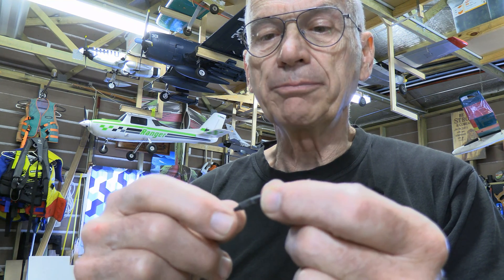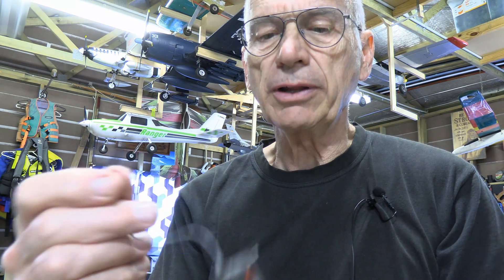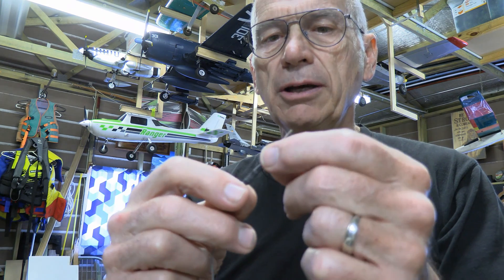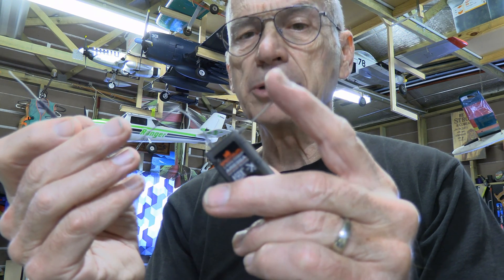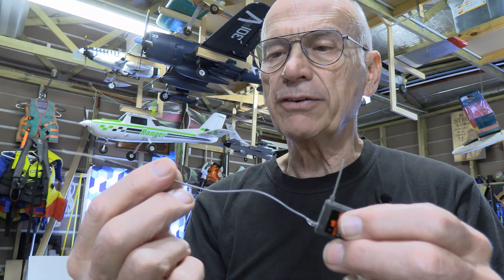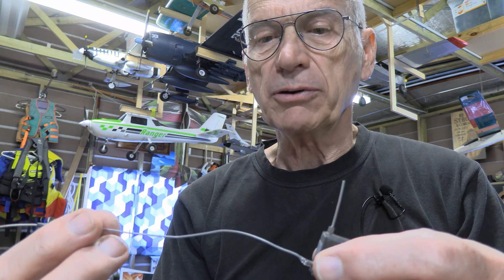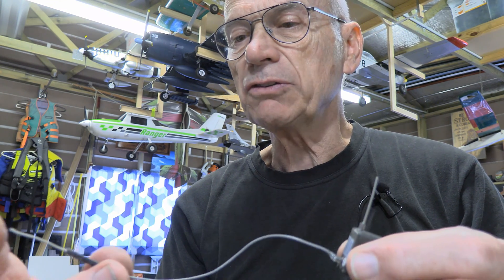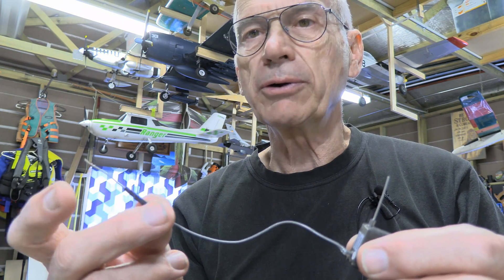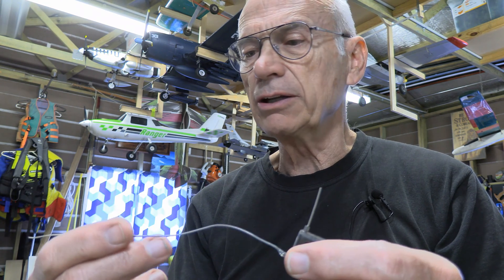That gives you extra ability to get the signal in there. It's also especially important for a telemetry-type receiver, which uses this for transmitting the signal back, because the ordinary antennas are fine for receiving but not as good for transmitting — the dipole gives you better range. The reason this is on a long wire is not that it needs a long wire for the antenna. It's shielded through here — grounded shielding around the wire protects it from receiving radio signal along the cable — so it just has the right length at the end. Don't trim that off; it's the right length to create the resonant frequency needed to amplify the signal and get a decent signal inside the receiver.